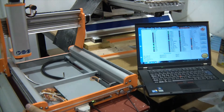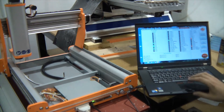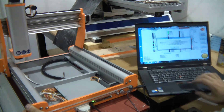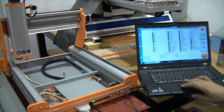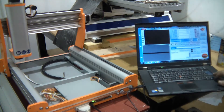This is a good way to test if your limits are working. You should be able to click the X, Y, and Z limit and see that. For example, if the limits were on, you would not be able to reset, because something is clearly pressed in your system. But if you release it, it will reset fine. So now I'm back in my run screen and I can start to move my x.